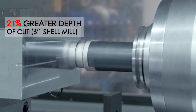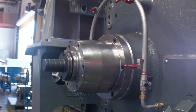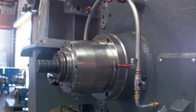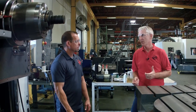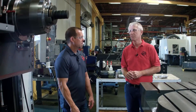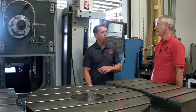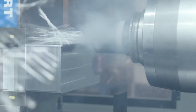The machine's faster, it's more rigid, and it cuts better — which is obviously an important thing. You guys redesigned the spindle as well. All machines now are getting our next generation 50-taper spindle and gearbox. It also has a non-contact encoder, which is an improvement over the old encoders — the newest generation of solid-state encoders. Much better lubrication system, and it works much better in a horizontal orientation than the old one, so we could speed it up from 6,000 to 7,500 RPM. The standard spindle used to be 6,000 RPM; now we're all the way up to 7,500 as a standard spindle.